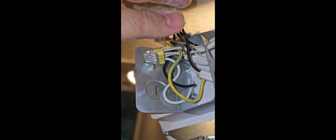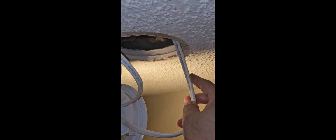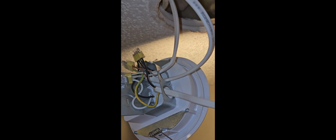And let me show you the wiring for where the split is. There you go. You see how there's 4 connections on each? So this wire is going to the switch. This wire is feeding the line on that side. This wire is feeding the line on that side. So there's a total of 6 recessed lights. I'm not hanging them yet because we're gonna scrape off this popcorn ceiling. So yeah, let me know what you think, guys.